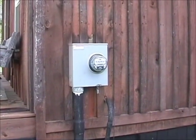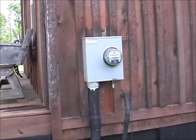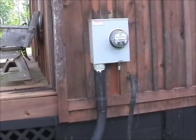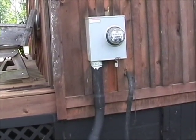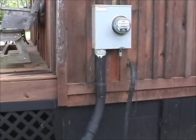As far as underground utilities go, rather than trying to guess and estimate where they may go, that includes your underground power, underground gas, propane tanks, cable, AT&T, your phone lines, cable or internet lines, all those kinds of things. You want to make sure that those are marked out and that you know where they're at.